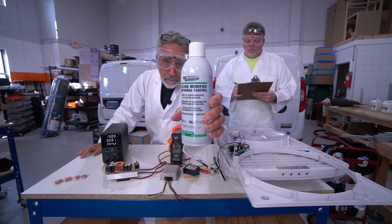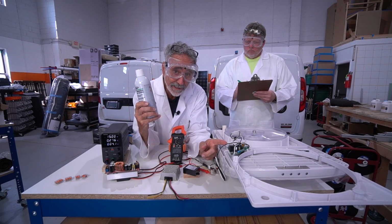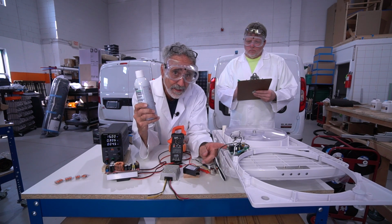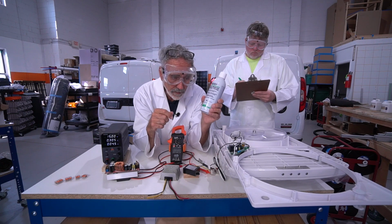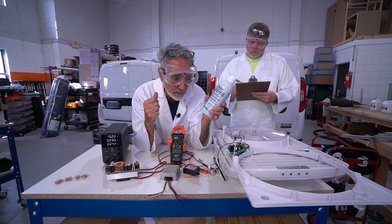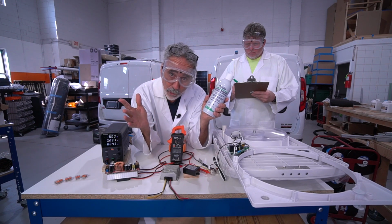conformal spray, silicone spray. Here's the problem. The motherboard, if it gets wet, condensation inside the fan housing, however this board gets any condensation on it, it craps out. This stuff, if you spray it on the board, it coats it, it waterproofs it. It doesn't hurt the circuitry, it doesn't make any connections like water would. Just spray it, it seals it, you're good to go.